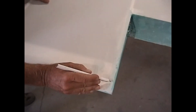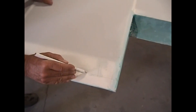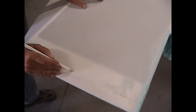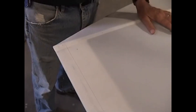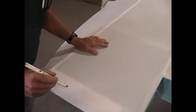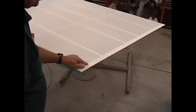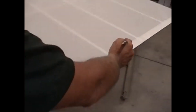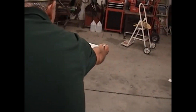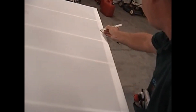We're going to take our pencil and come back — we want a good inch to an inch and a quarter overlap here. What I try to maintain on this width right here is the same width that we have on the trailing edge of the wing. We'll do our overlap glue joint, it's going to come around over into this area here. I just like to make a pencil mark — it gives me an idea of where I'm going to glue to.